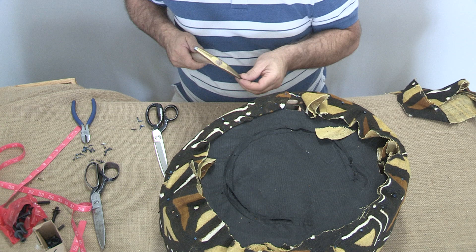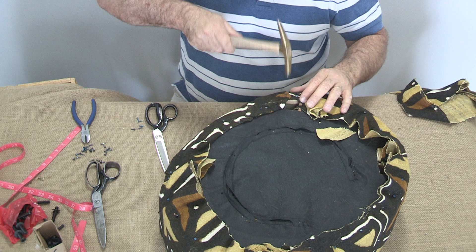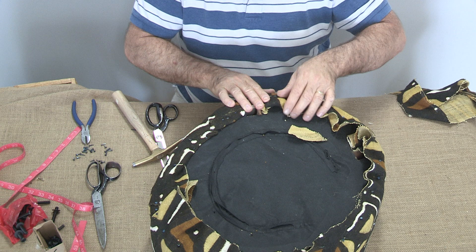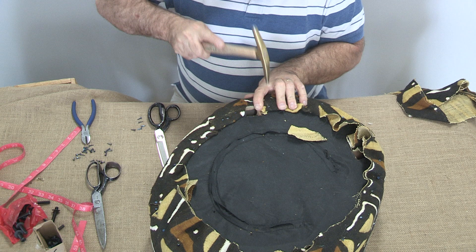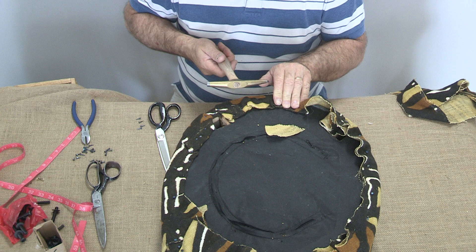So that's pretty much done. These pin tacks can be put all the way in if you're confident it's tight enough — and we are, we went through the tightening process. The hardest part is around the pleats, getting a tack in there. It's going to look good with the leg in there. We could take a staple gun out here and staple this, but not everybody has a staple gun. If you did have a staple gun, you'd be doing the same thing — pleating this over and just stapling instead of tacking.